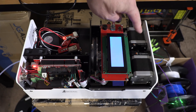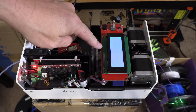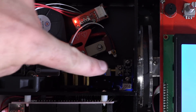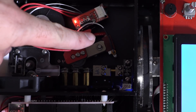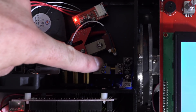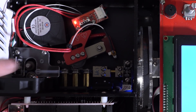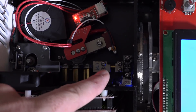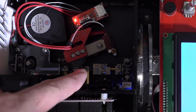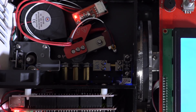There's the insides. Here are the motors that are drawing the filament, and they go through PTFE tubes that are underneath the display. The filament comes into this tube — this is a little heater, be careful, it's hot — on an arm, and that arm brings the heater to the tube, heats up the filament. Using this motor back here, it squishes the filament together when it's warm, and then slowly extrudes it out over these rollers, through this tube, and out the output motor.